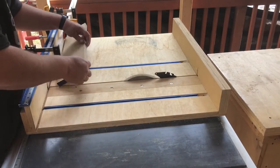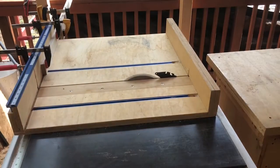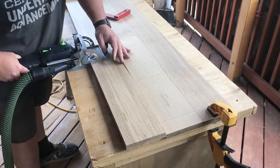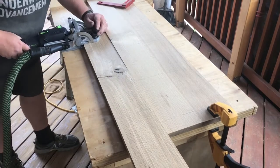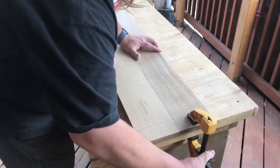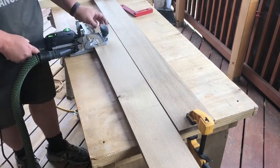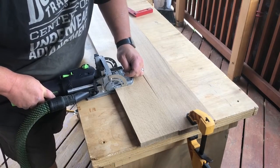The first thing I'm doing is a clean cut to make sure I've got a clean edge, then pushing it up against the block and cutting to length. The first parts I'm working on are all the parts for the case. Now I know this one board is a little wonky but that's okay because I've got another one going wonky the other way. The reason I didn't joint these, even though they're a little wonky, is because my jointer is just too small. So what I did was get one of them flipped around and I'm going to clamp them together using dominoes and edge-glue them. That'll help pull it back into place — and I know a lot of people are going to say that doesn't work, but I've had really good luck with it.